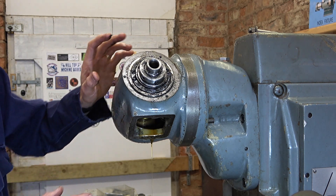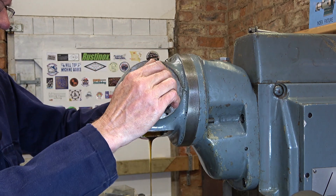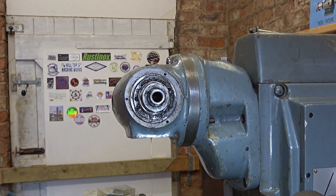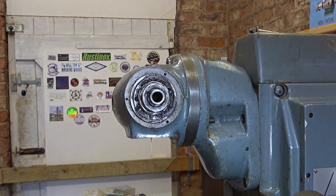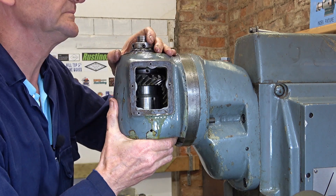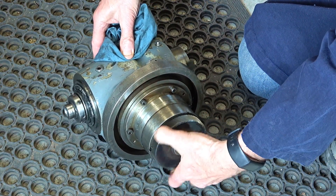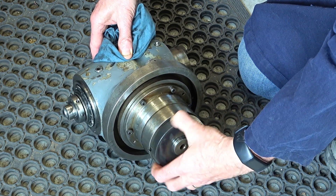I don't think there are any other collars stopping it from moving, because I've already moved the bevel gear upwards. So it's a bit strange. Unfortunately there are no shortcuts — I'm just going to have to figure it out, take it off and check it. Because it was getting so hot you couldn't run it above about 1000 RPM without it getting ridiculously hot. That feels like too much resistance for just one bevel — something's not right.